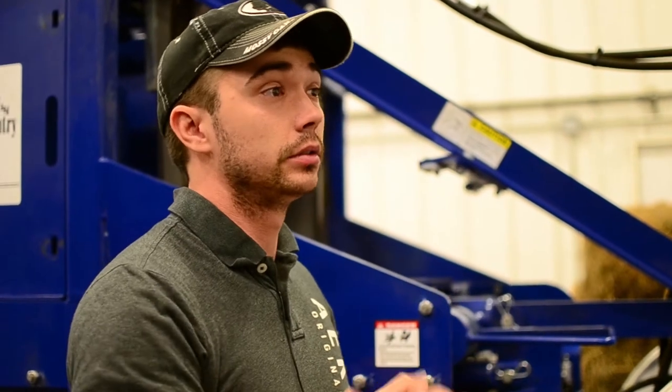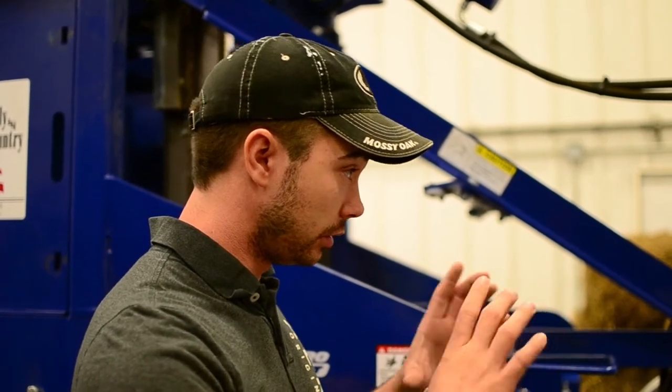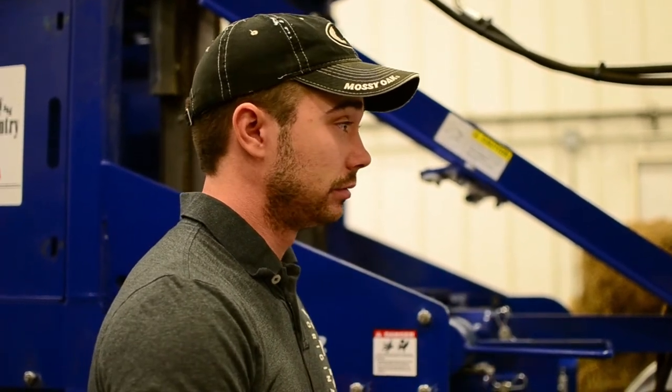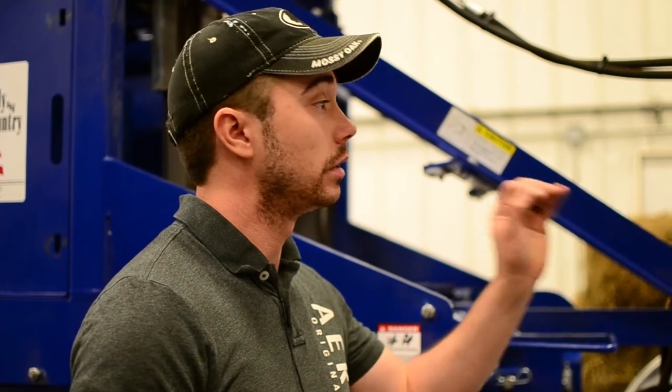Inputs, outputs - I can't stress this enough. If the machine stops, look at your monitor. I did tech support for quite a while and nobody knows what the monitor says - I can't help you. The iPad will tell you what's happening. With the iPad, you actually have the monitor box. That is going to be your lifeline. I can run a machine by just looking at the red and green lights, but it's slower - you have to unscrew it. The monitor is going to tell you exactly what it's looking for.